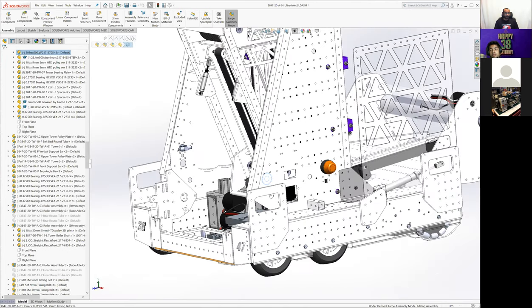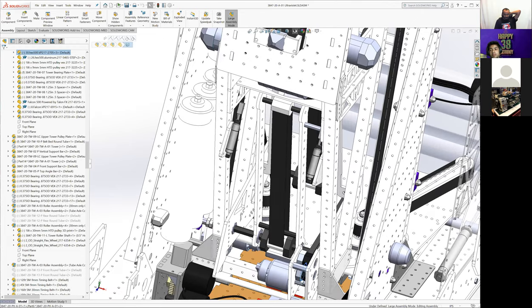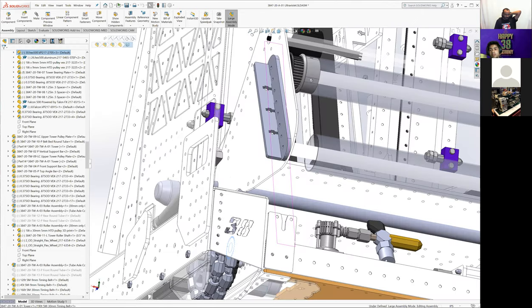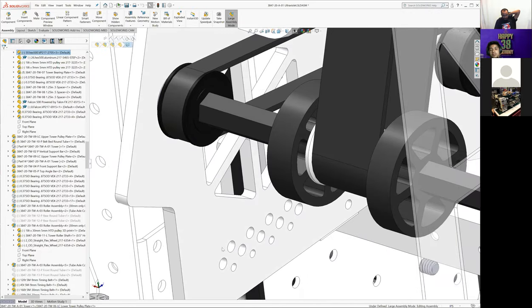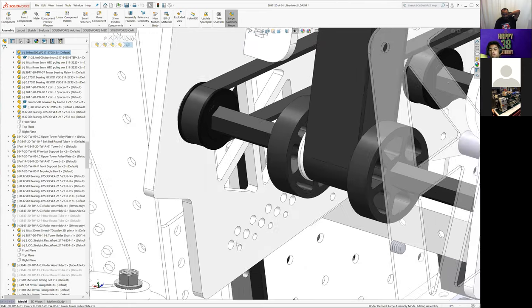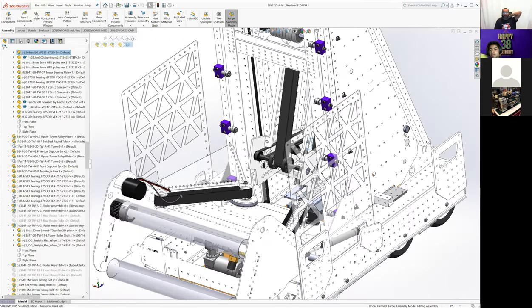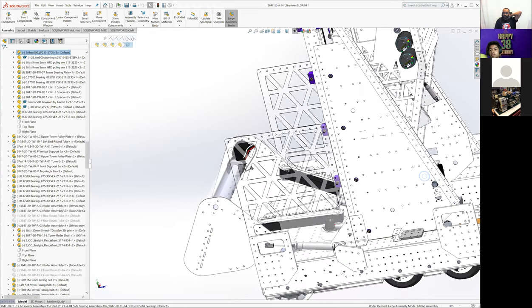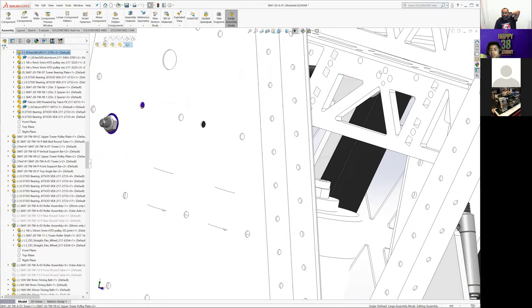Yeah, okay. So one of the ways that we let the ball stack on each other, we do have sensors in here. There is an IR sensor down here. I want to say this very front hole is where we currently have it mounted. So it's set up to where you have the IR sensor through this top and the zip ties go through these sides and around it. So there's an IR break beam sensor here and a receiver on the other side. And there's one up at the top as well. So we do have some ways to play with it in programming to tell where we have balls a little bit. So there's one up here as well.